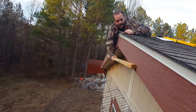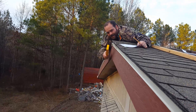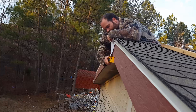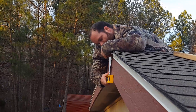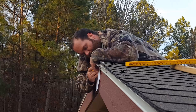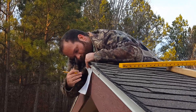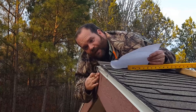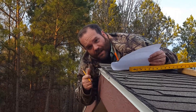I also want to know the actual pitch of my roof. The easiest way I can think of: I'll take a level, make sure I'm holding it level, put a piece of paper up against the eave of my house right on top of the level, and then draw a line right up against the eave following the roof line. Now I can cut the 2x4 to the same angle as my roof line and get that bracket as high up as I can, maximizing the gap between the two brackets to hold the mast more securely.